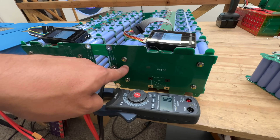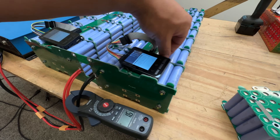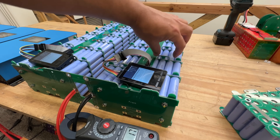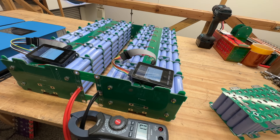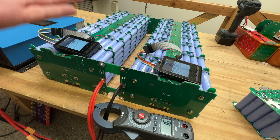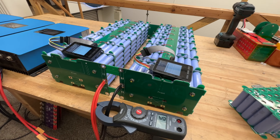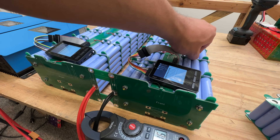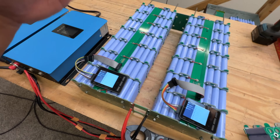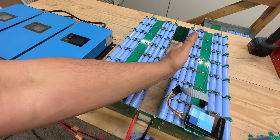The pieces conducting the power are in between those two bolts, which is probably where most of the torque will be seen. These exposed sections are touching but there's no pressure in there yet. In the future, if this works really well, we could take those off — but I think it's a good idea to leave them. If a battery isn't conducting power from one module to the next even after torquing, you could simply throw a bolt in there to help. I'm trying to make this super simple — no bunch of wires, and that includes the BMS.